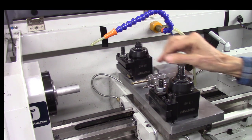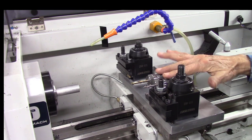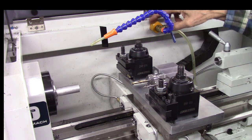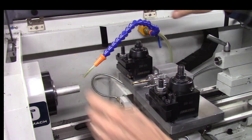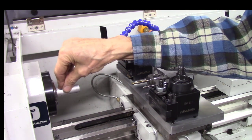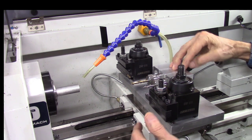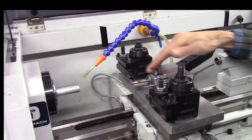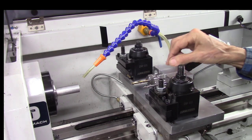I got enough space in here, but I couldn't get a fourth tool in — there just wasn't enough clearance. So the max I can get is two center drilling type units and two tool posts: one for profiling and one for cut-off. I'll be mounting my cooling system up top so it sprays on the part and gets all the tools as they're going through. I did a prototype — I used some Delrin to do my first run just to make sure everything clears, because everything is tight here and you're working really close tolerances between your material and your pieces. I had to make a few changes: I had to move my tools back because I thought I could put my center drill forward, but this was in the way. But there's a lot of versatility with different holes in the plate, so it can be adapted to different types of materials. This works well for three-quarter inch material and smaller. Anything bigger than three-quarter inch may be just limited to three tools instead of four.